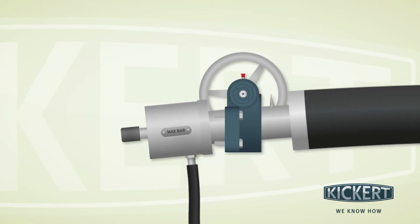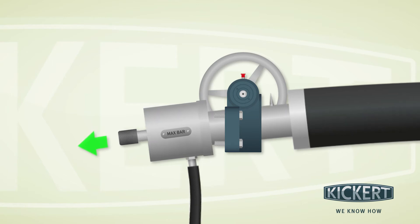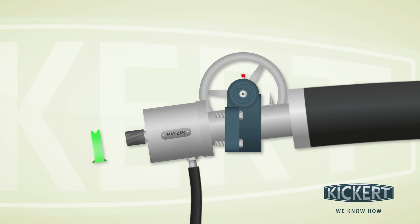When you generate the roller bow, the axis on the operating side presses out of the cylinder. To maintain the desired bow height in the long term, lock the axis by tightening the lock nut manually. The curvature is now fixed and the pressure can be released.